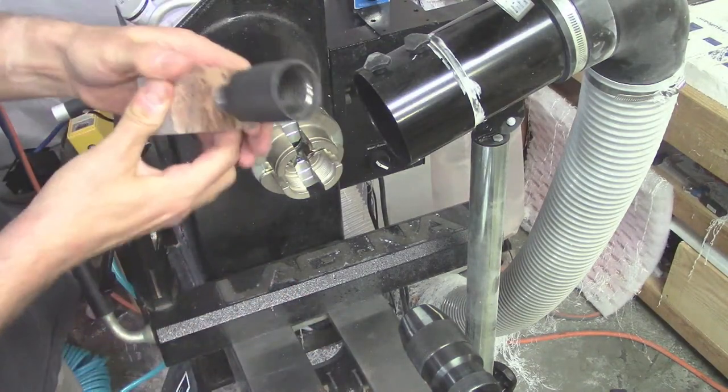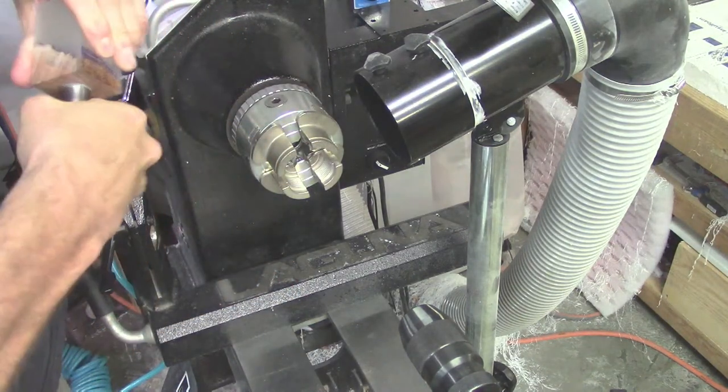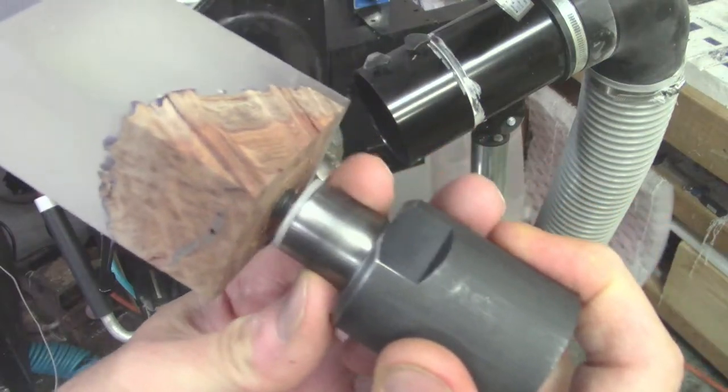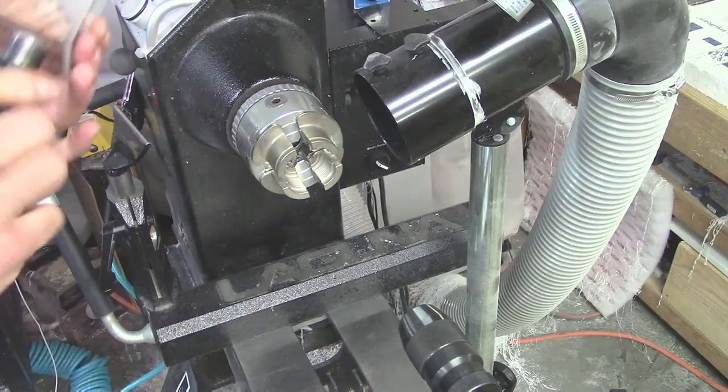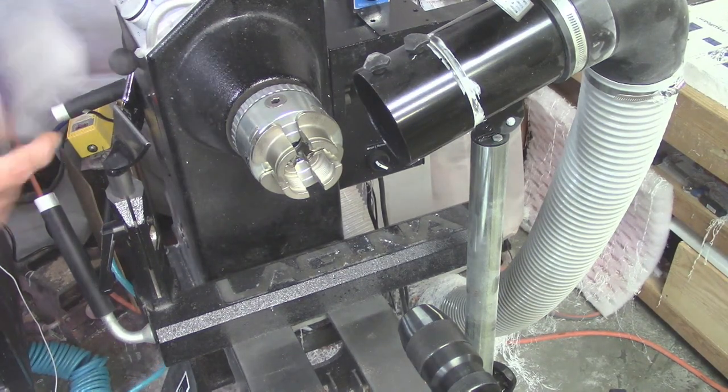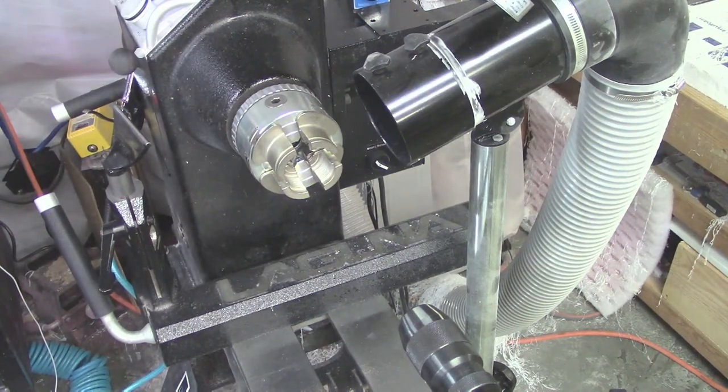And this is the universal mandrel. It has bushings. So this is from stainless bottle stoppers. The nice thing is it's kind of like pen kits, where they have different bushings depending on the kit. And this one is, I think, the 13/16, something like that. Hold on a minute, I'm not sure what the number is. I don't change it a whole lot, I just know it's the bottle stopper one. Yeah, it looks like 13/16, I think, is what this sleeve is. But they have different ones for different kits, and it'll match up to what that bushing does.